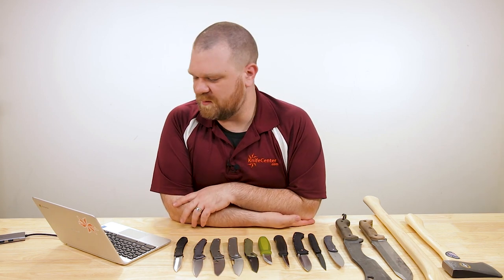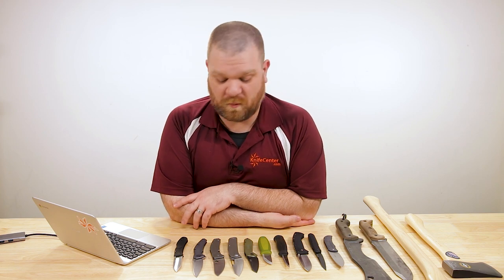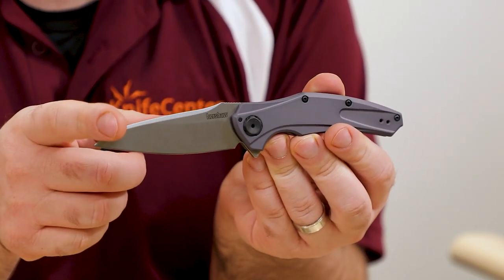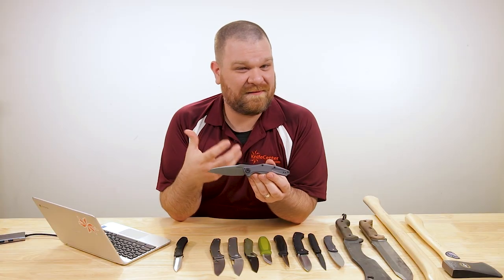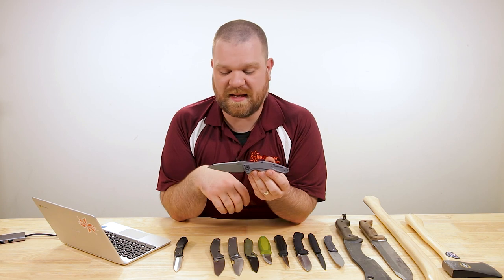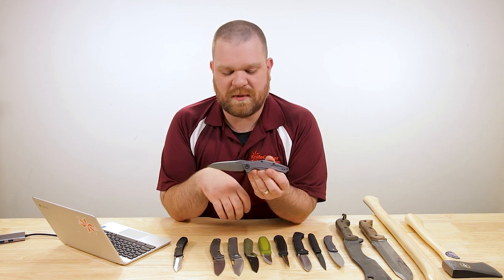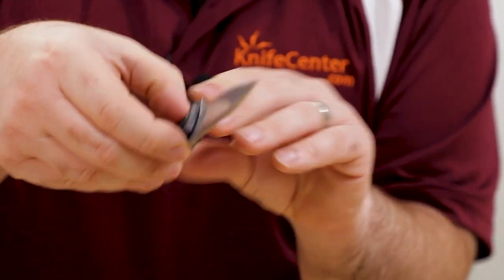In answer to your question, there's not really a whole lot of flippers in any kind of carbon steel. So I have an off the wall suggestion for you here. That Bare Knuckle again. That 14C28, that Sandvik family of steels, behaves similarly to a carbon steel, just in a stainless format. It hones easily like a carbon steel will. You can get a good fine edge with them. Maybe check that guy out. Long question, but short answer for you this time.